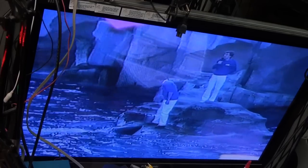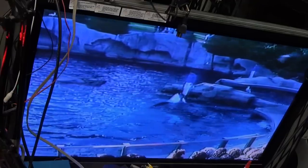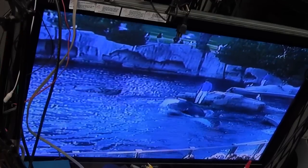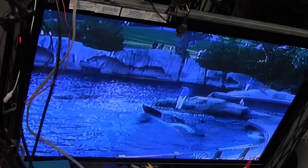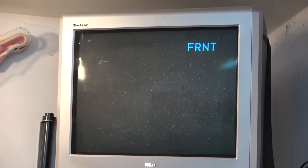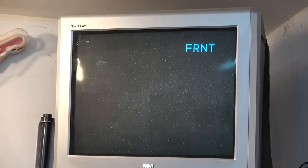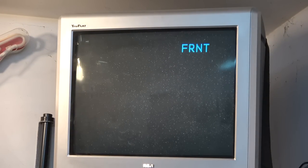You can see there's some picture instability, because the dropout compensator is firing in error. If we turn the dropout compensator off we'll get a clearer picture with no dropout compensation, and we'll see the dropouts showing up as white streaks of snow. On a CRT TV we probably won't even see that. I can confirm it, because of the way analog TVs operate. That set up there — I use it for looking at my security cameras, and as an analog monitor when I need a CRT.